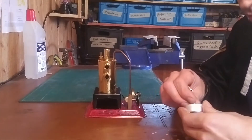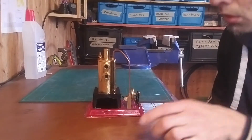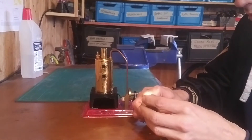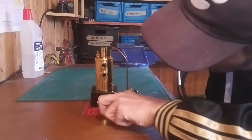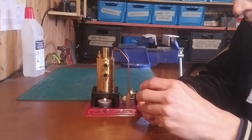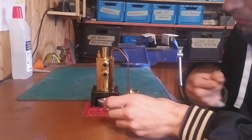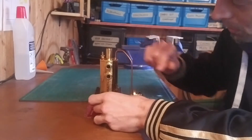Let's start the thing up just to see if it still works before we do any other work. I wanted to use standard paraffin candles to fuel it — they come with pellets to get the fire started, but I wanted something household-wise that just works without going to the shop. I filled it up with water a few minutes ago. You should use distilled water — otherwise the minerals and calcium could clog up the small tube.